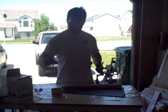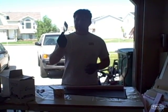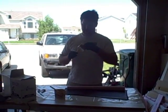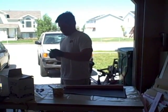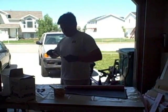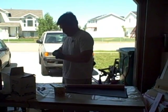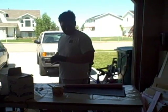So we went ahead and got our epoxy mixed. I've also got here a three-inch paintbrush, just normal — I get the cheapest ones I can find because after I'm done using it here, it's no good. One thing that helps a little bit: these bristles are sometimes a little bit loose, so I go ahead and pull out as many bristles as I can so they don't get into our carbon fiber layup. This paintbrush I got at Harbor Freight — it was 79 cents.